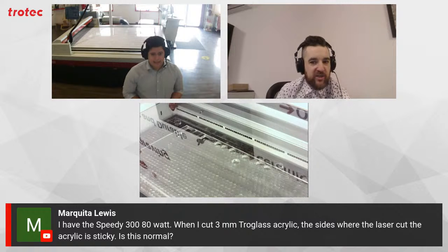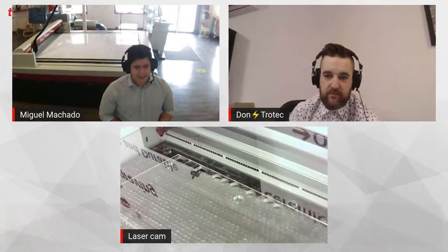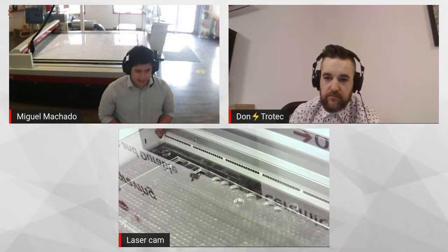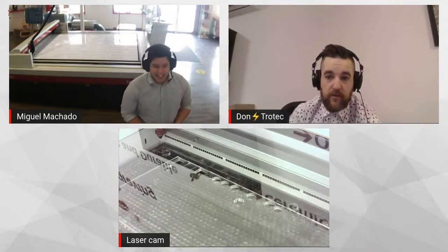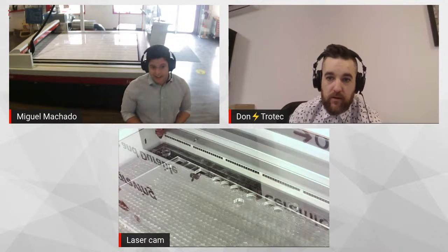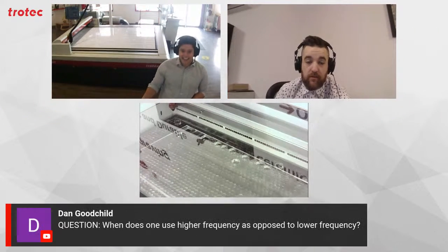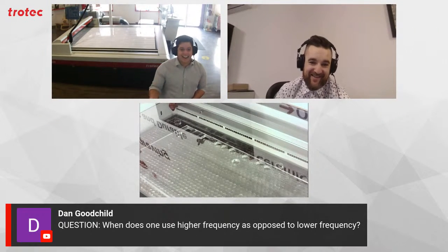Do you know by any chance what the acrylic is? If you put the name of the parts in the chat there, maybe we could help you out a little bit more. But it could be extruded acrylic, and she's cutting with a huge frequency and not using proper assist. That's the only thing that comes to my mind. I've never seen acrylic being sticky. I mean, they're hot, but they don't stick to my hand. That would be dangerous, actually. Imagine me taking out something I just cut on the laser, and it sticks to my fingers and is really hot.